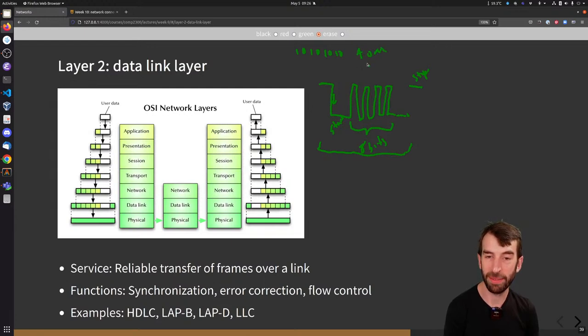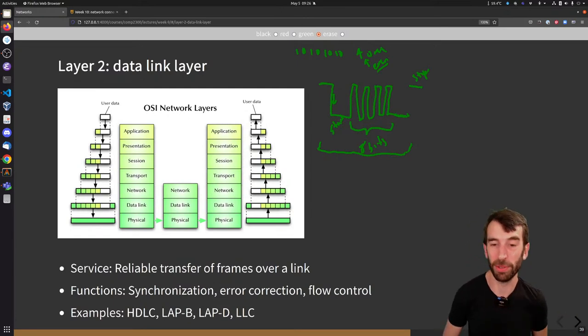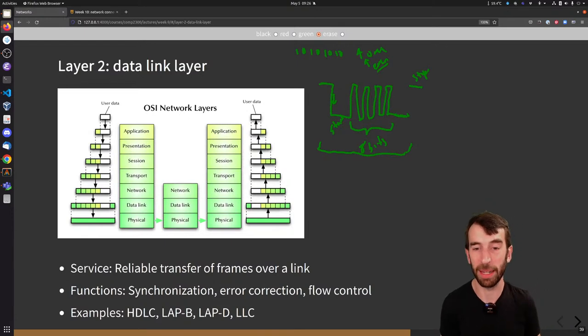And then we see 4, well, that's an even number. And so we make our parity bit either 0 or 1, depending on our choice. So in my case, I'm going to say that it should be 0. There's two options, right? You can either have it 0 if it's even or 1 if it's even. It's a configuration option, right? There's different ways of doing it. It makes no difference. It does the same thing.